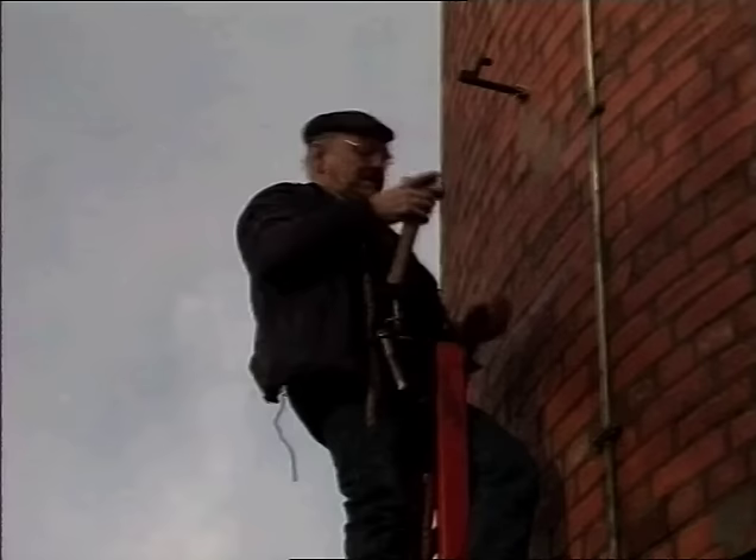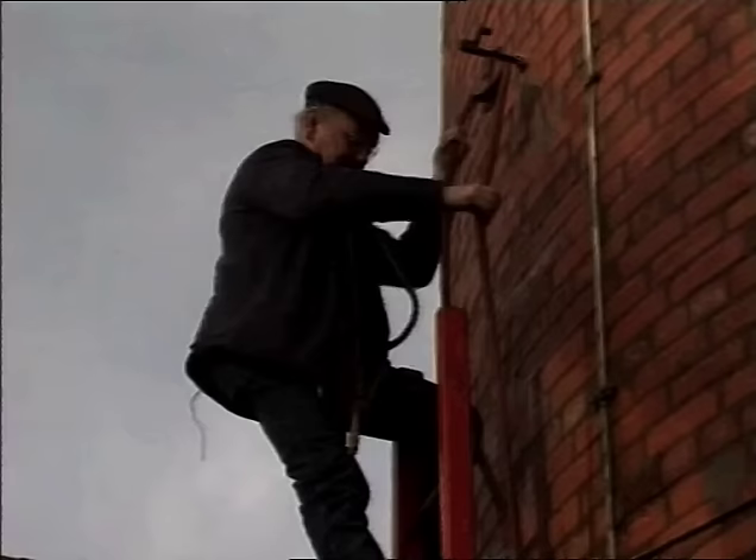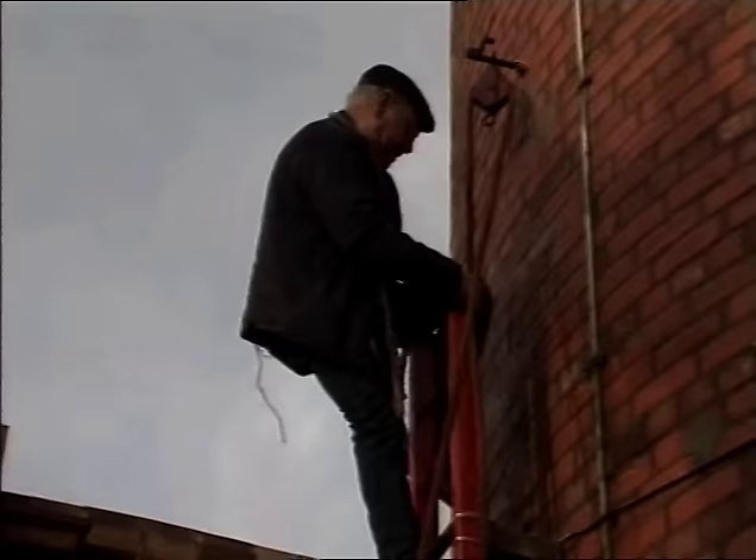If you put them up and wander to one side when setting up the staging at the top — say one ladder has gone two foot sideways and another has gone the other way — it looks rather erratic at the top, with everything out of line and out of square. Now we've drilled the hole approximately five feet above the top of the bottom ladder and hooked on the pulley wheel.